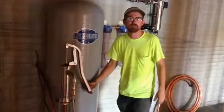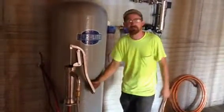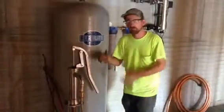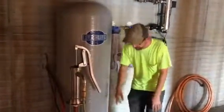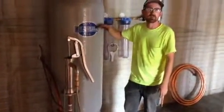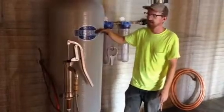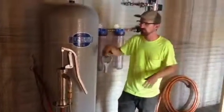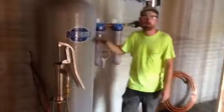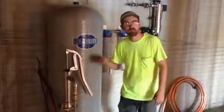Let's say they run out of power for several days. They just come down here in the morning, making sure this valve is open, stroke the pump, build up water pressure. You'll see the pressure gauge build, and this will store the day's pressurized water supply so they can use it without having to pump all day long. They can use their water, and then the next day they'll come back down and pressurize it again with this hand pump. Thank you for watching.